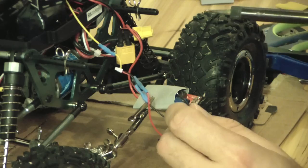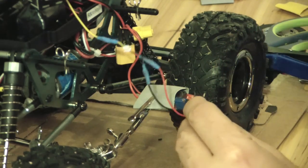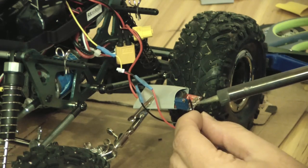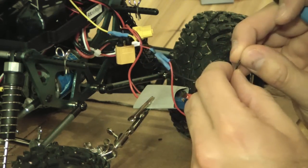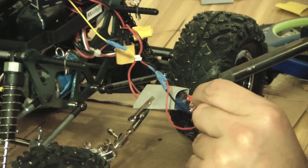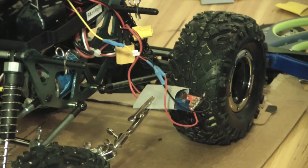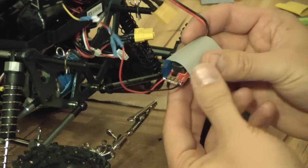After that step, you simply connect your device on the output side of the regulator — in my case a camera. And don't forget to put a heat shrink over the voltage regulator first, because otherwise you'll have to desolder the cables again. That's something that happens to me quite often, but if you watch out, it won't happen to you.